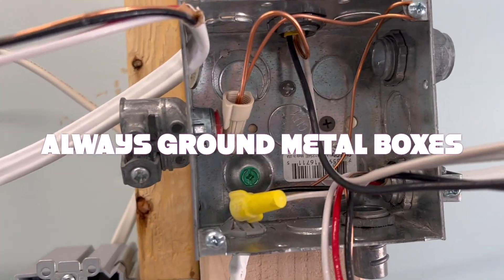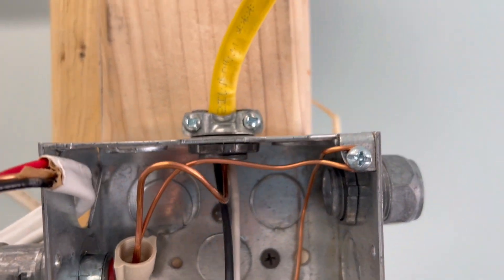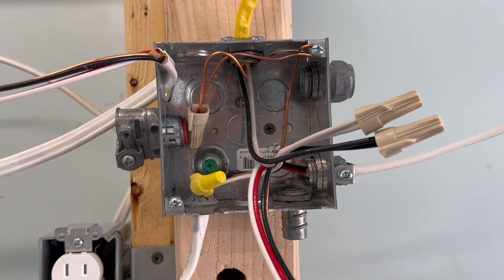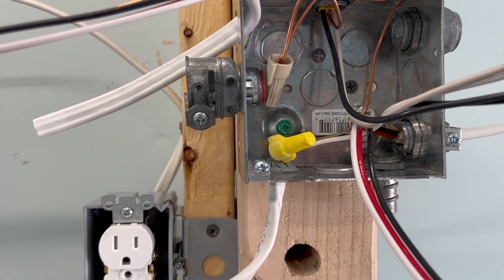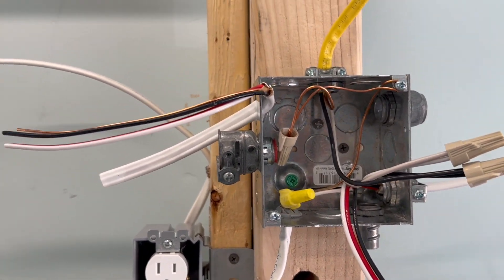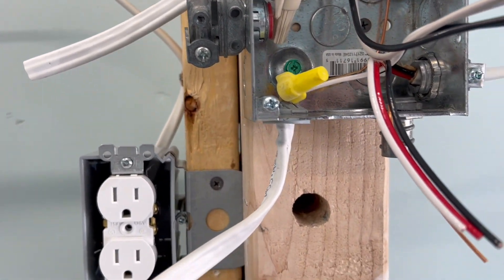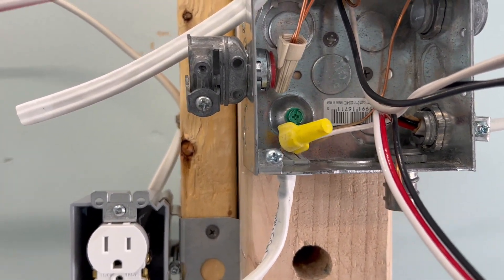Now let's look at another potential mistake. This yellow is always identified as number 12, a 20-amp circuit. What is it tied into? If we follow it around — it's tied into this Romex 14-2. A lot of people jump off of a 20-amp circuit with 15-amp wire. In essence, the wire should burn before the breaker trips. That's why you don't put a larger breaker with smaller wire. If you have a 20-amp circuit, you keep it with 20-amp wire, because an appliance on that circuit can cause it to heat up. So that's our second mistake.